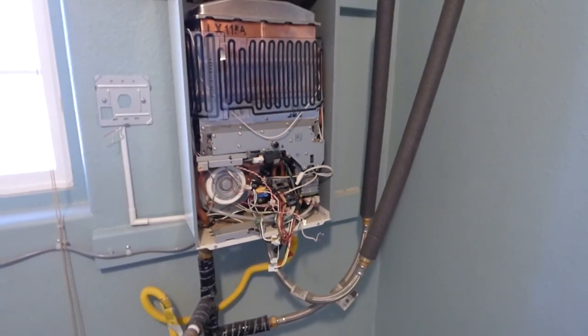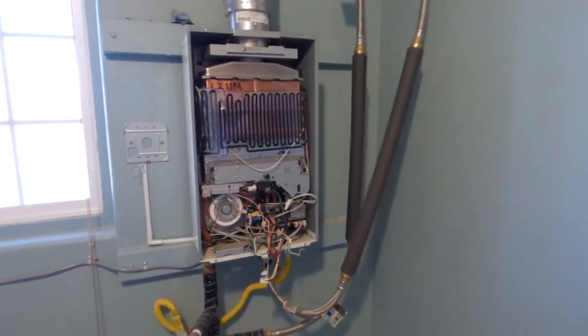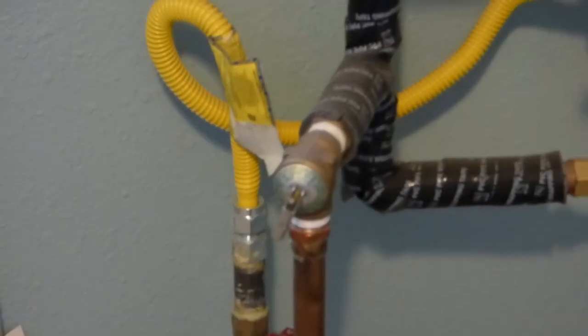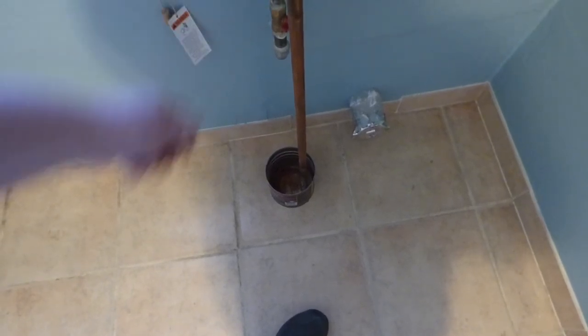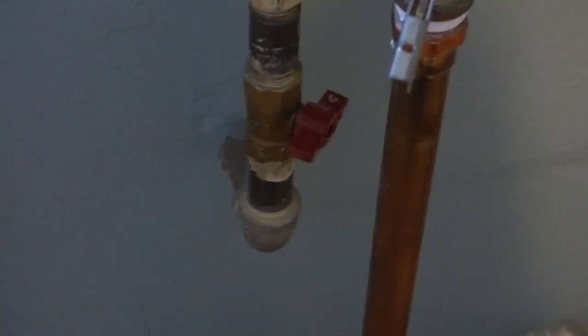Next, you can let some of the water drain. Get the lowest outside spigot in your house, turn it on, let the water kind of backflow out. Turn on some faucets inside the house — the hot water would be a good one — it should help suck out the water from this thing. We also have this pop-off valve here and a bucket down there, so if I pull on it it's going to drain some more water into this magic bucket. The other thing I've done here is the natural gas comes in here — turn that off, because you don't need that on right now.